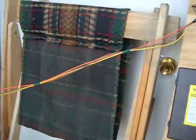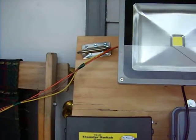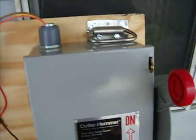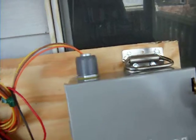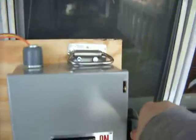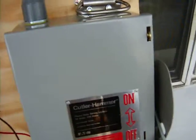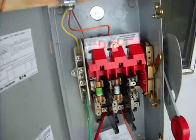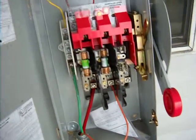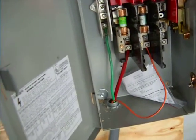I'm using this 14 gauge 3-pair wire right now temporarily to hook up the panels downstairs. We'll run down there in a little bit. I've got that coming in, just kind of terminated into this primary 60 amp rated connection — got everything coming into here, a positive and negative.